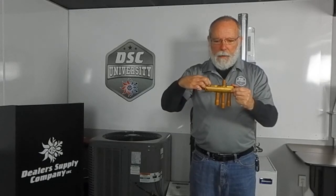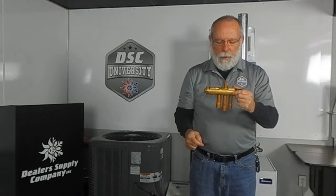Hopefully that gives you a little bit of insight into how a reversing valve works, how the slide works. We have the little bathtub in here that actually connects two tubes together depending on which side it's at, and then we have the center port that comes from the discharge off of the compressor. Hopefully that helps you out a little bit and will allow you to understand better the operation of the reversing valve. Once again, Wayne English here for DSE University. Have a good day.